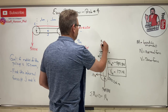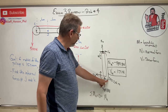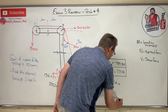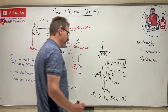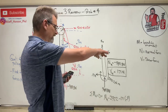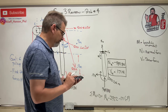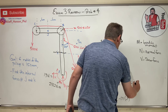To find Mk, take moments about point K. The moment Mk is positive (counter-clockwise as drawn), minus Ma = −292.2 N·m, and minus Ax × 0.9 m = −171 × 0.9. Moving the negatives to the other side: Mk = 292.2 + 171 × 0.9 = 446.1 newton-meters.